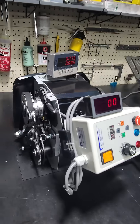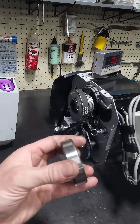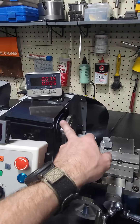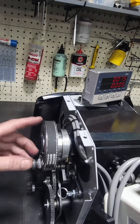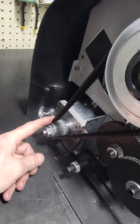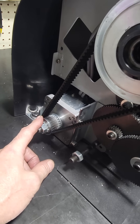These Amazon lathes, they come with just normal stuff right, like normal bearings like this. I went in there and replaced them with tapered roller bearings — super high precision. I put a system on here where I could preload it, and I have a 900-watt, 1.2 horsepower motor running on here.